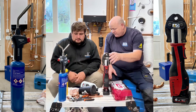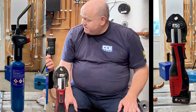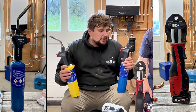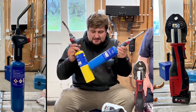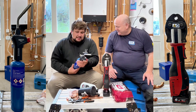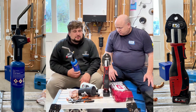Can you tell us what's the difference between the blue and the yellow bottles? Simple — one's propane, one's MAP. Now apparently MAP is slightly hotter, it just feels a little bit different. A lot of the time you get used to one and just end up using that one. I was always told blue was for apprentices, yellow was for the pros — or blue was for DIY. I don't think there's even any price difference; if there was absolutely no yellow in the shop I'd just get blue and it wouldn't make any difference.